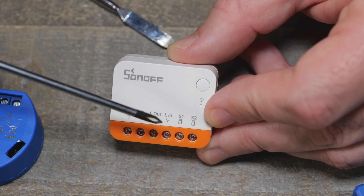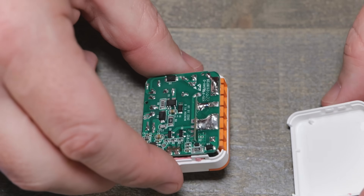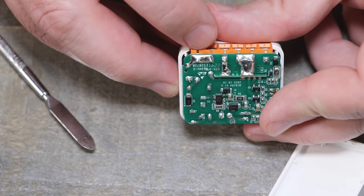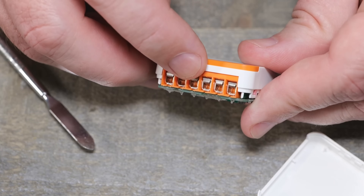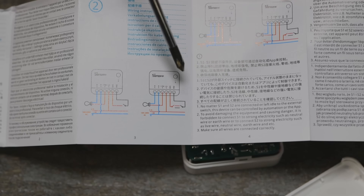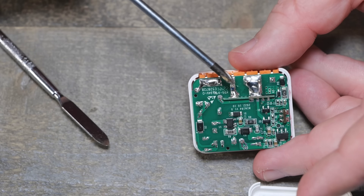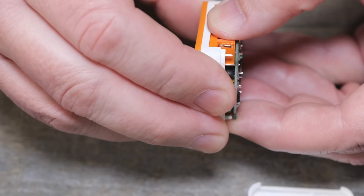I wish the Shellys would do that as well, especially on AC voltage. There are no screws, no glue. Looking inside, the neutrals at the top are soldered together, and these two pins are soldered together as well. Interestingly, they want you to use S2 when using a mains switch — but actually, you'll still need to use a mains AC-rated switch because it appears mains AC flows through that switch point.